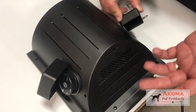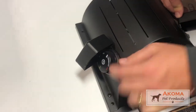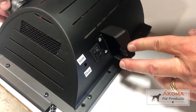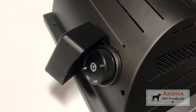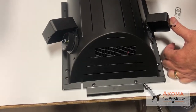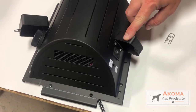This unit can be set on one or the other — you don't have to have them both on or both off. In the summertime, if you just want the vent on, you would turn the dial to the off position, turn just the vent on, and then set the thermostatic dial where you want it. You're telling the thermostat: if it gets hotter than say 60 degrees, have the recirculated air come on. Only the fan will come on — it's an external and internal fan bringing in air from outside. The heater does not come on at all because it's in the off position. This unit is now a recirculating air unit only.